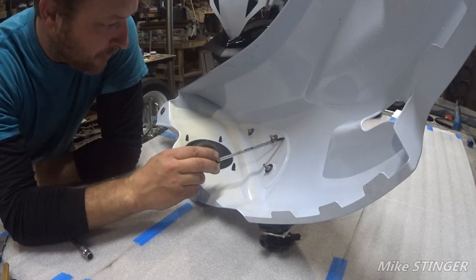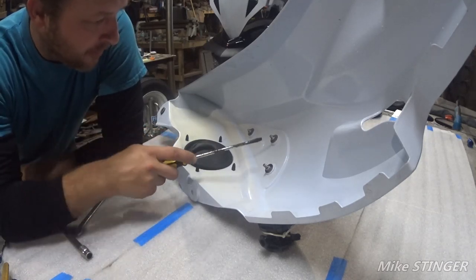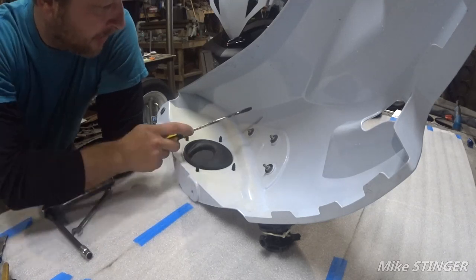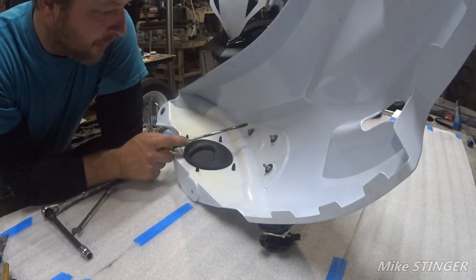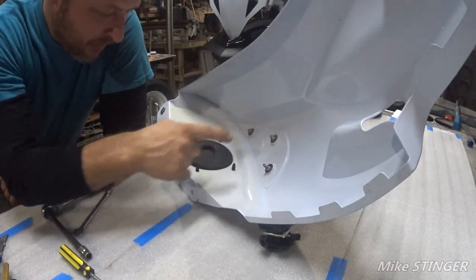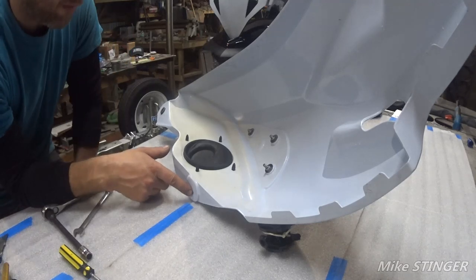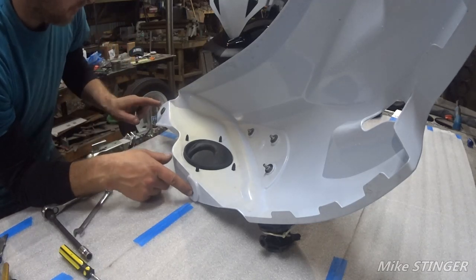when we form a plate that goes from here, curved like that, and it comes down here, we can actually put a reinforcement in at an angle like this. So once we do that, this part is going to be nice and strong. And from there, we're going to link out with the arm coming in this way. So that hole will be in place, and then we're going to come out this way.